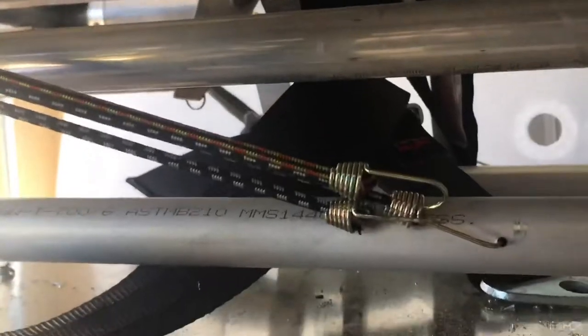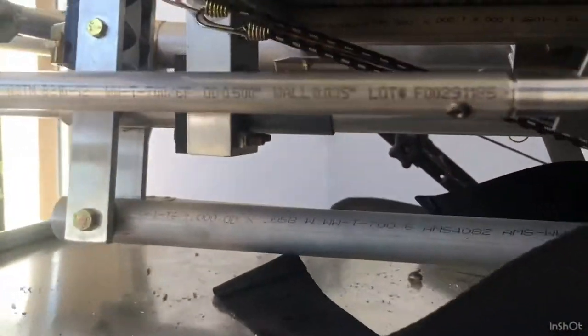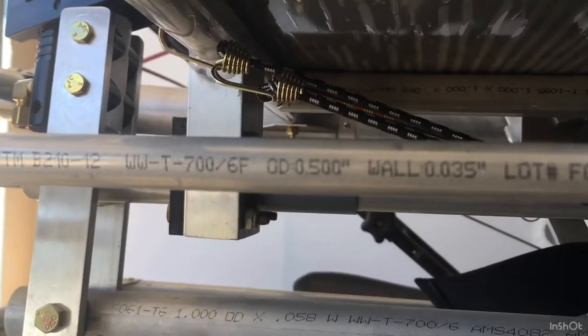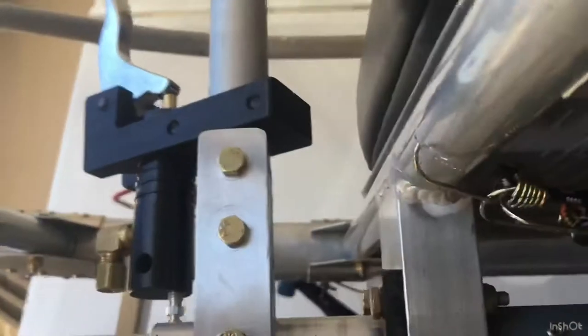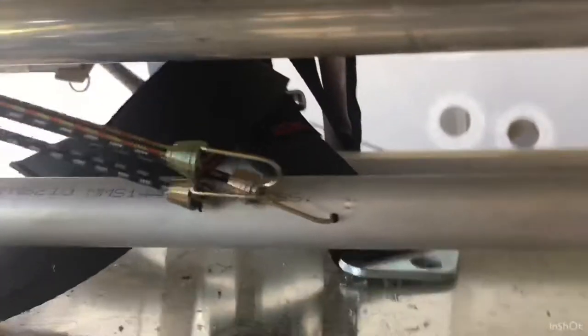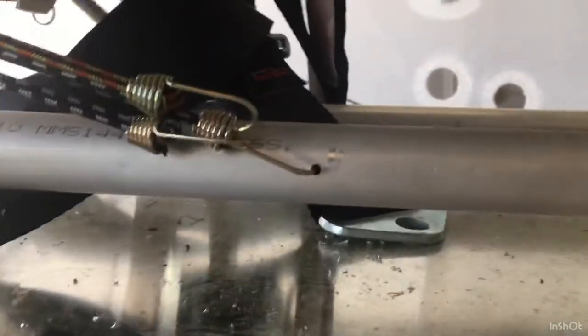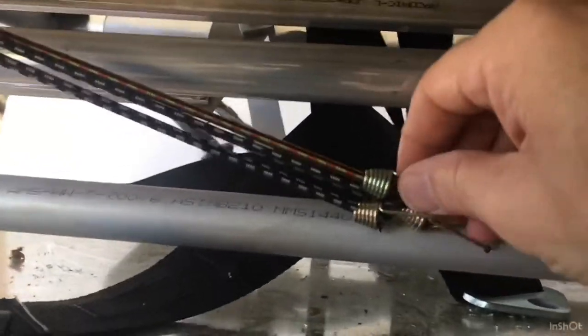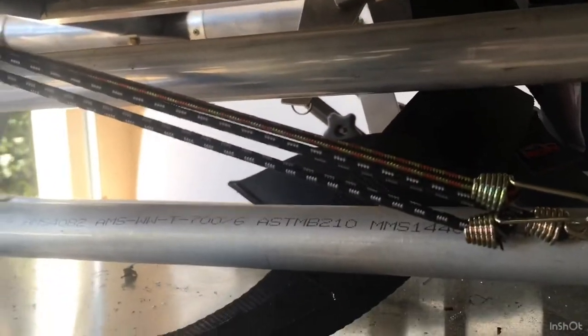Here's a nice little trick you can do: just put a bungee — but you've got to get ones with aluminum or metal hooks so you can tighten it down. I just put a hole in there. Typically guys will put the bigger hooks in around the seat, but I couldn't fit mine, so I just drilled the hole. Then you come down to the lower elevator push-pull tube, drill a hole in that, and put in as many as you need to give a neutral balance on the stick.